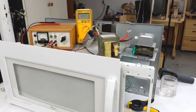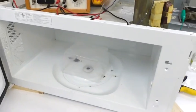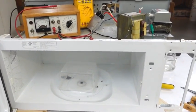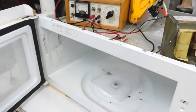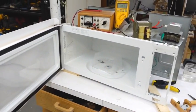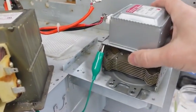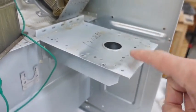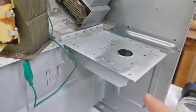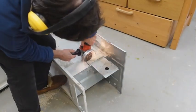For the sake of YouTube views I should think of stupid and dangerous things to put inside this wreck of a microwave, but that's been done before. So I was thinking: why should I limit myself to microwaves inside the box? I should let the microwaves be free. I could try operating the magnetron without any enclosure, but I think the waveguide will help concentrate the microwaves, so I'll cut it out and try it outside the box.